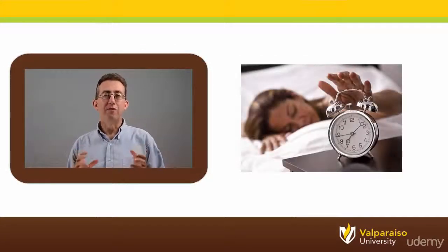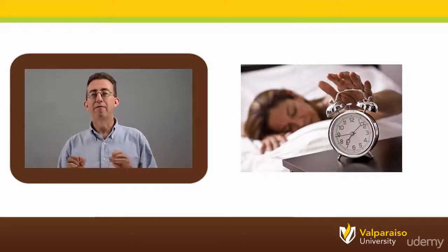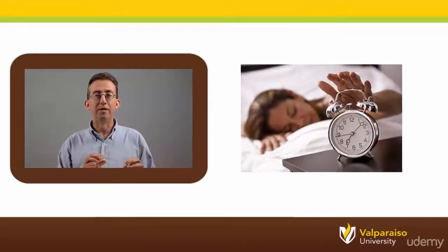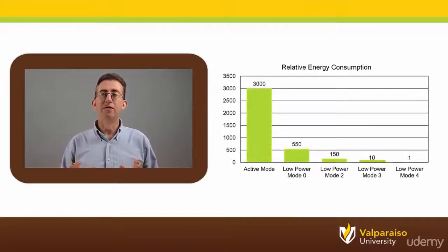In this section, we learned that the MSP430 can be put into what is called a low power mode that reduces the amount of energy that your microcontroller consumes. In low power mode, while the peripherals may be operating, the CPU can be disabled. It does not execute any additional lines of code, and this can significantly reduce its energy consumption — and that's a great thing for battery-powered devices.